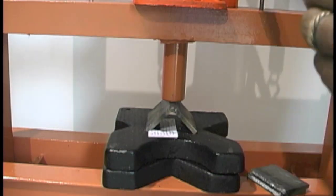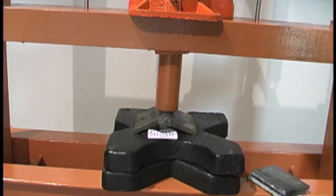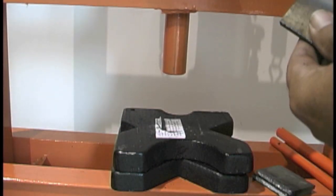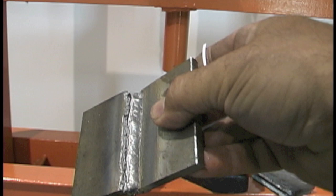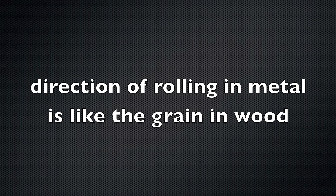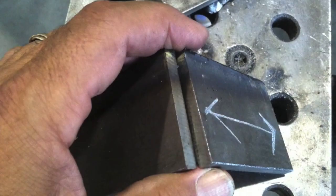With both sides welded, let's see what that does. Much better — still gives in the end, but it pulled the plug out of the base metal right next to the weld. The reason is the grain of the metal: this is two-inch bar stock, and the direction of rolling is much like grain in wood. So I'll take that same piece, orient it differently, weld the outside corner and then the inside, put it in the press, and see what happens.